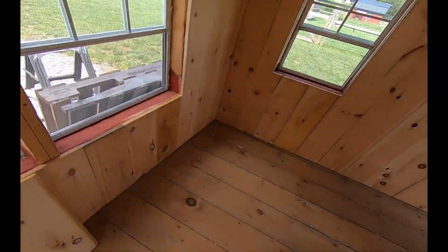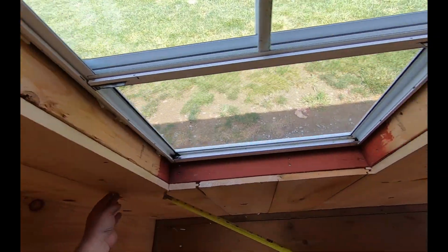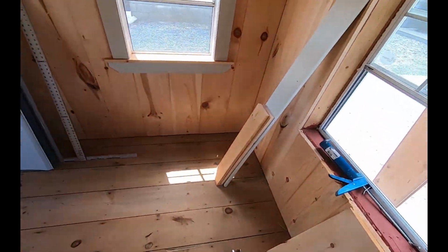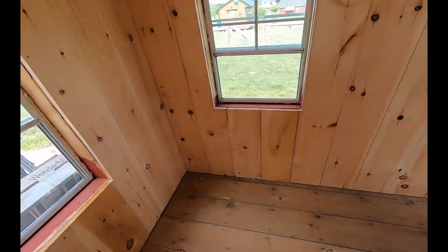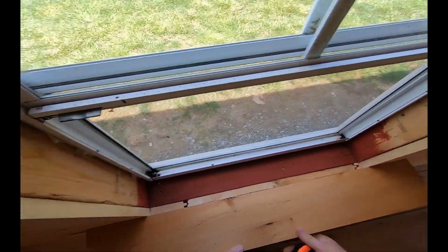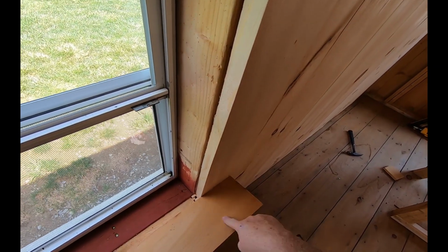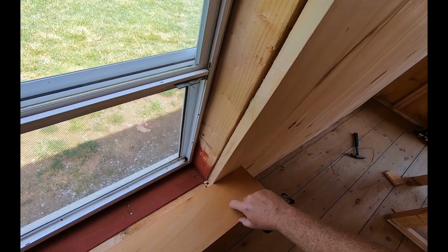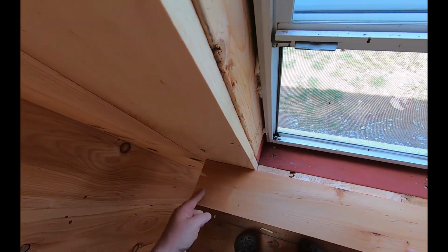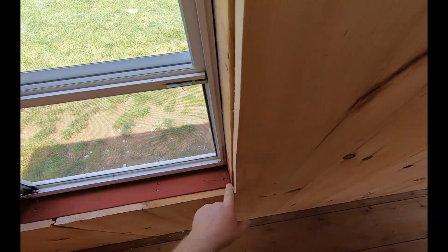So I'll show you what I'm going to do. I need a board 31 long, 5 inches wide. I just happen to have those cut right here. So there's the board. But it doesn't fit. Yeah, I gotta cut these out. I gotta cut a corner out of these to leave that little lip out here and a little lip over here. So I gotta cut a corner out. So all I'm gonna do, I know I need 21 and a quarter for the opening.